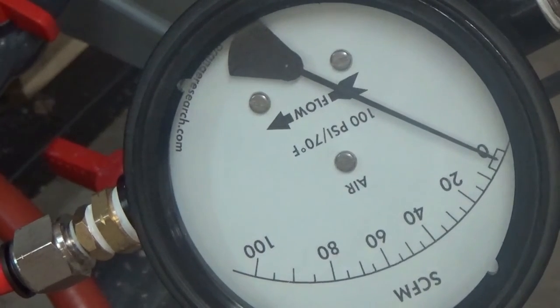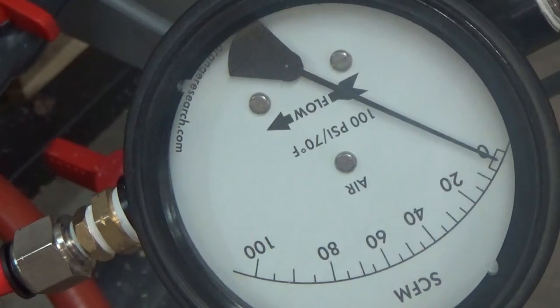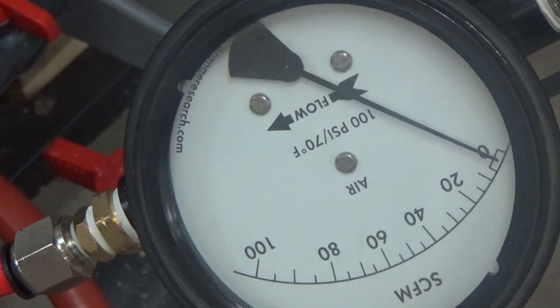20 CFM is required here at the 50 to 60 PSI working pressure with a 10 millimeter ID tip. These are the pressures required to operate this machine effectively. Can you use a lower CFM compressor or air source? You can, but you have to understand that the machine will have to sit and wait a few minutes for your compressor to catch back up. There are many different ways to optimize your setup to help with CFM, but that's something we can cover in a later video.